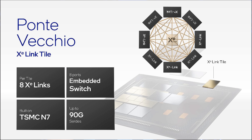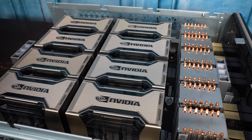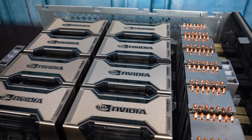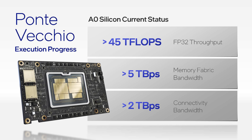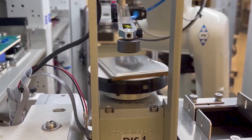Another really important feature is the eight Xe links coming out of these GPUs. The importance is having an interconnect that is very fast — with those 90 gigabytes per second links — because you have to move a lot of data between different GPUs as you build out high-performance GPU clusters. NVIDIA is doing it with NVLink, and that NVLink architecture uses a ton of power. The advantage is a cache-coherent interface with a ton of bandwidth compared to PCIe and lower latency, but it takes a lot of power because you're moving a ton of bits really fast. Intel is already talking about over five terabytes per second of memory bandwidth and over two terabytes per second of interconnect bandwidth.